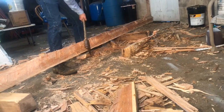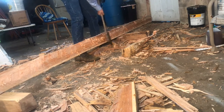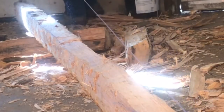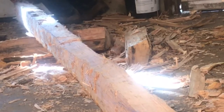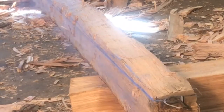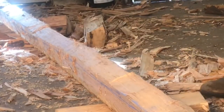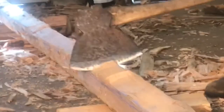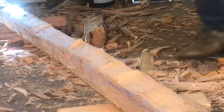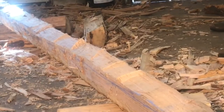Dressing up is very difficult work for a double-beveled axe — not impossible, but far more difficult than it is for a single-bevel broad axe. Now I establish the top of the timber and run a chalk line down both sides, which gives me a level plane to work on. I go along the top of the timber and make shallow cuts to ensure that I don't rip out more material than necessary. I may have to make two passes on this surface to make it perfectly flat.